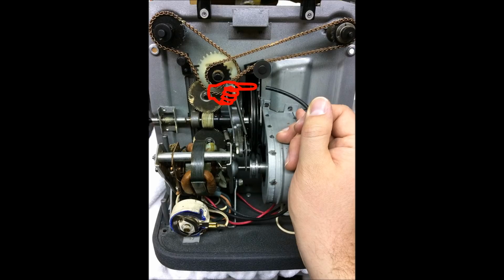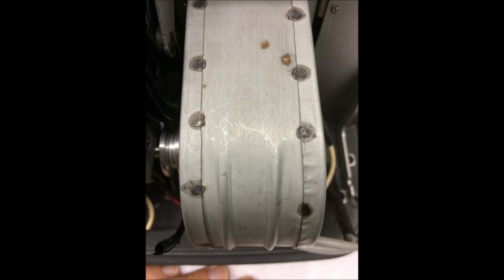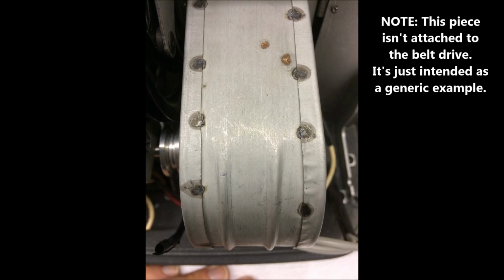Now, I've encountered a lot of dead belts in my time, so I was prepared to simply replace it. But while digging around the guts of the projector, I found that the according wheels and such were inaccessible. As it turned out, unlike most of my old gear, this projector was largely riveted and machined together, and the belt was evidently done very early during the factory assembly process.